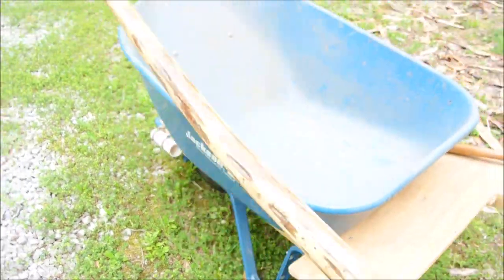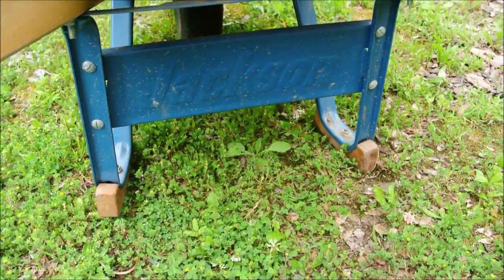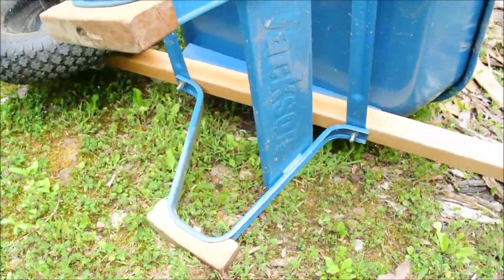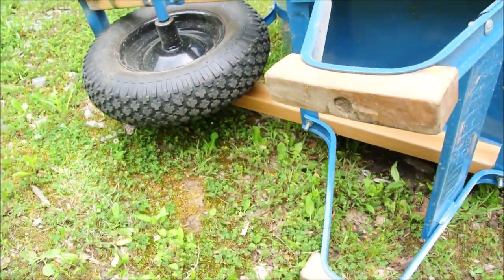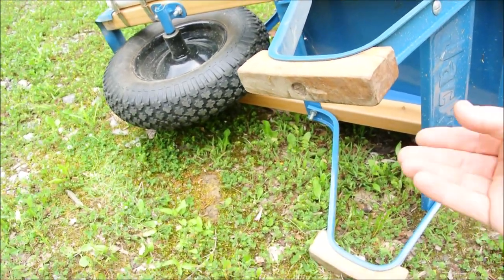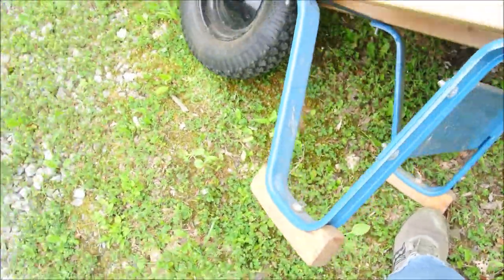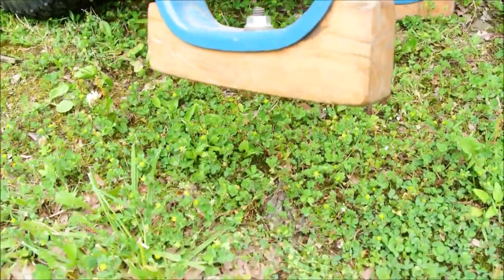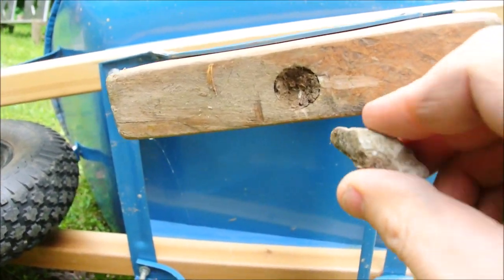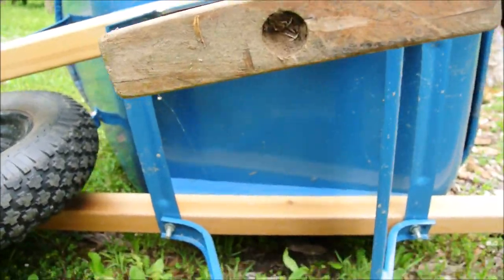This handle doesn't count because it's homemade from a branch — I have a video about it if you want to see. And last but certainly not least, this is probably the most important: a pair of hardwood skis for underneath these skids. This is nice because it won't dig into the dirt so much, it won't scratch your driveway, and if you have it on some delicate floor or concrete it won't leave blue skid marks everywhere. I think I used hickory, but oak, maple, cherry — anything somewhat hard will work. You'll just have to come up with some kind of bolt and countersink it in there, then secure it down with a nut.